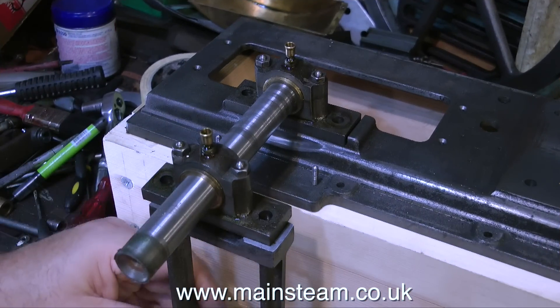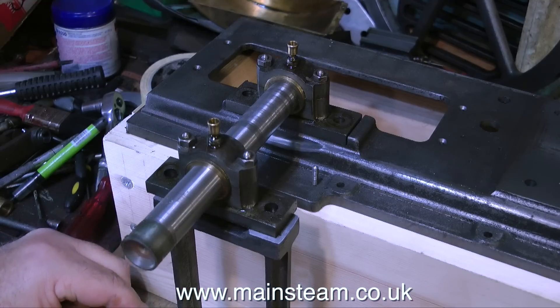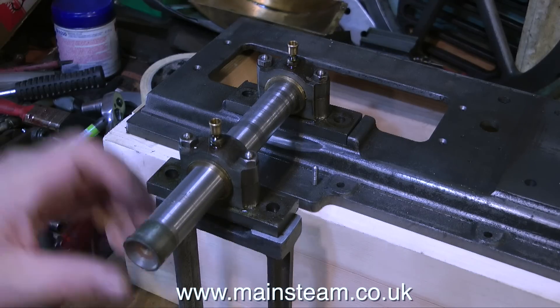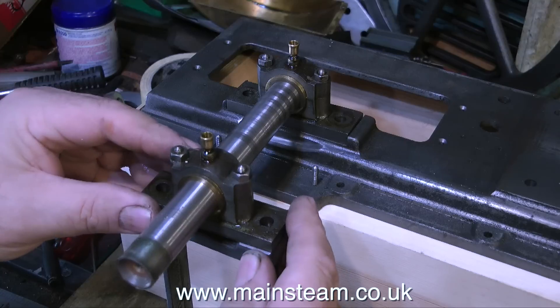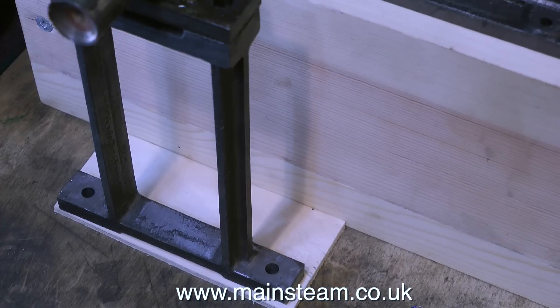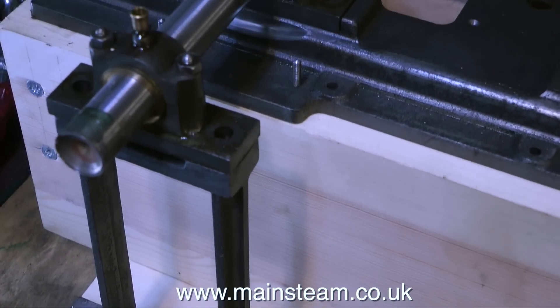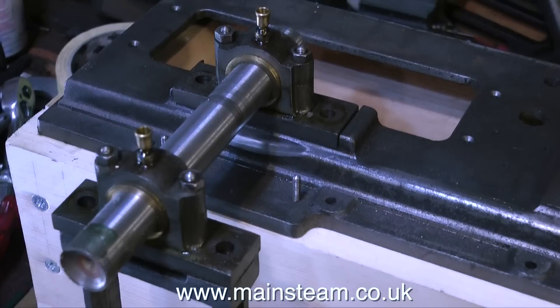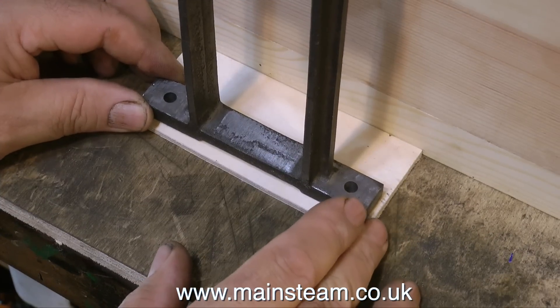In this clip I'm taking a quick look at the level between the bearings on the bed plate and the pedestal. The crankshaft needs to be aligned to the bed plate at a perfect 90 degrees, so some adjustment will be required on the pedestal side. I'm going to try packing the pedestal to see what kind of packing I need to level up the crankshaft — at the moment it's looking like about 4mm or about an eighth of an inch. The final packing will be a piece of steel, similar to what you see here but much neater and smaller. Ideally I'd use a piece of steel angle an eighth of an inch thick, bolted to both the baseboard and the box for a very rigid fixing.